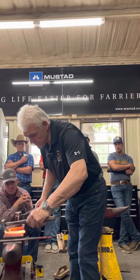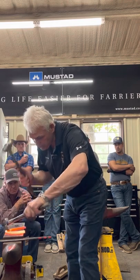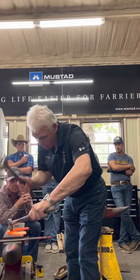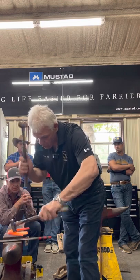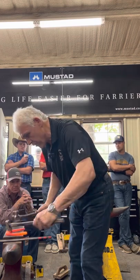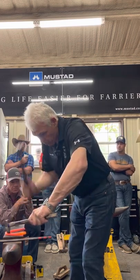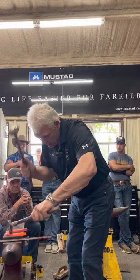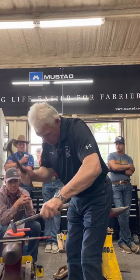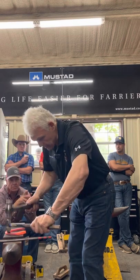I'll pull it to 100% now. But I don't hit it too hard. It's very hot. If I hit it hard, it'll just blow out. So I've got to go through it 3 more times to get down there. Otherwise, I'll destroy what I'm doing. If it gets a bit colder, I can hit it a bit harder. So I'll get it to 60%.